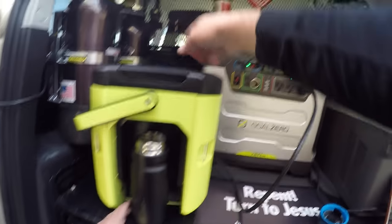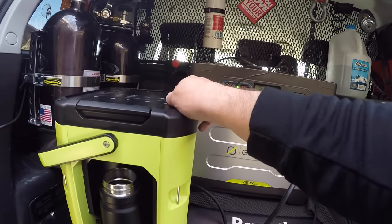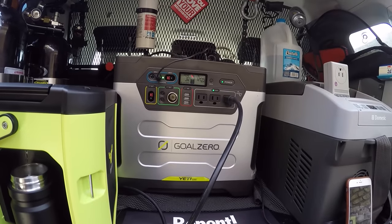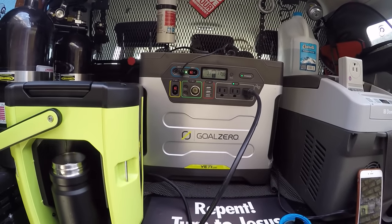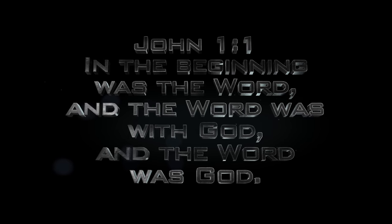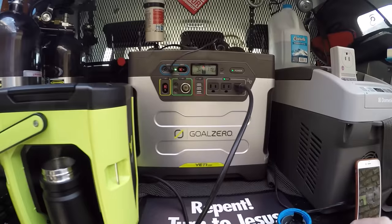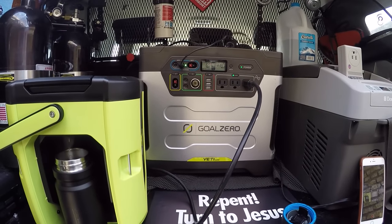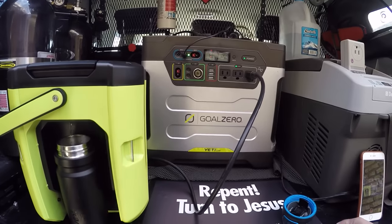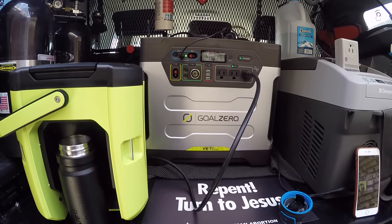Now I'm going to switch over to water and pick the largest cup size — I believe that's 12 ounces. We're automatically kicking in at about 1200 watts. I should advise you that I did try this the other day. I hadn't driven the vehicle in a couple of days and the Goal Zero was already at 60% before I started the test, so it didn't finish my first cup of coffee. If you're going to do a couple of cups, a bigger inverter would certainly be the way to go.